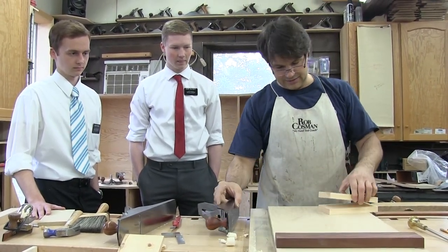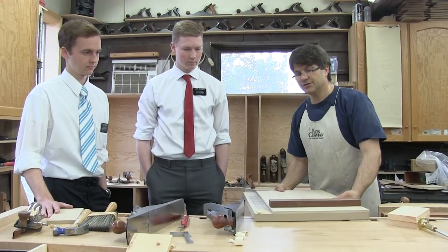The nice thing about a shooting board is it prevents me from having to try to balance the plane on the same piece of wood if I had it stuck in the vise. So the ends are nice and clean — easier to see our knife lines.